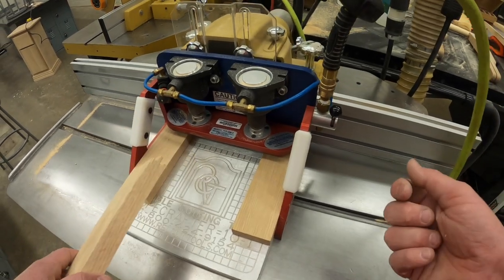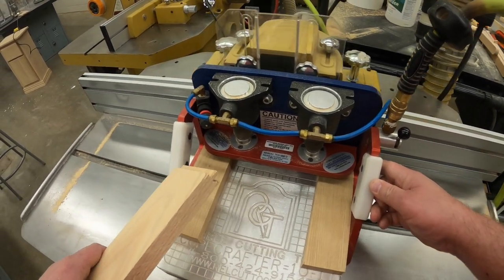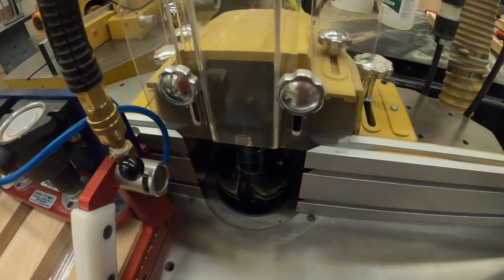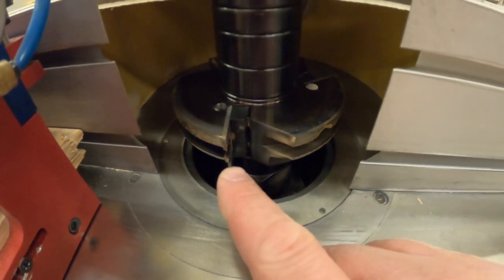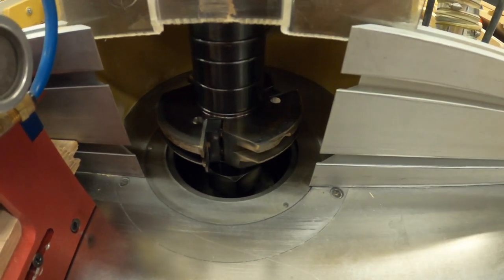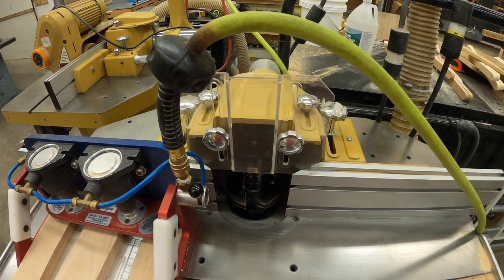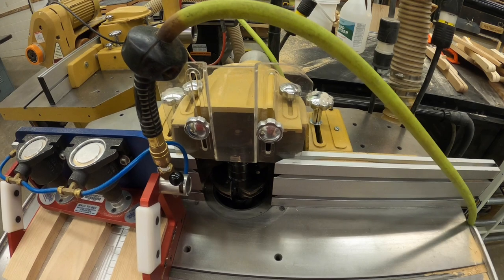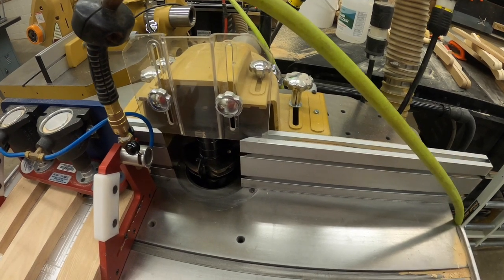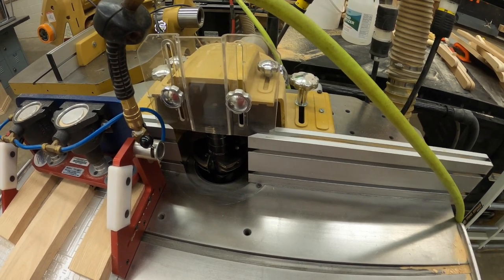You may have noticed that the cope crafter is worked from the right side to the left side of the machine. You know which way to go based on the orientation of the blade — that flat sharp edge is the lead edge of the knife, and it rotates in a counter-clockwise position. If it's spinning counter-clockwise, you feed the work piece in that direction, against the cutter. On a shaper the direction can be changed to forward or reverse, but typically this setting is not messed with — your instructor will have the machine set up and you simply run your pieces through.